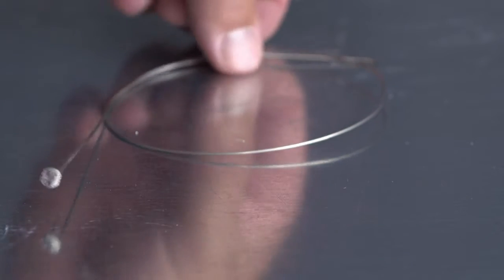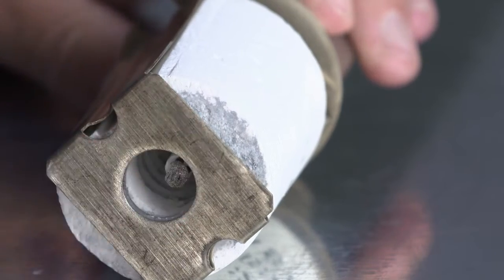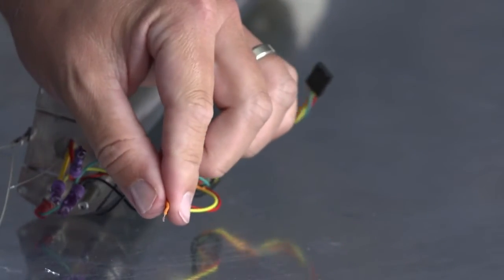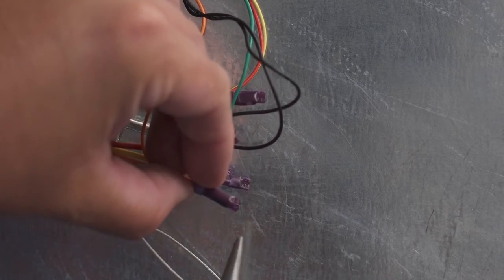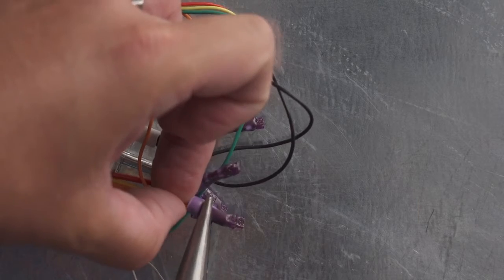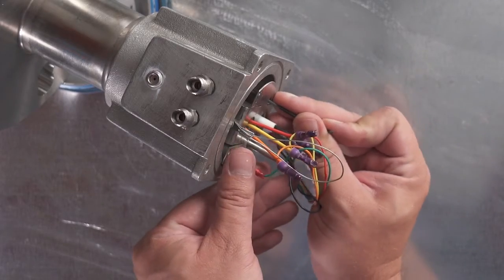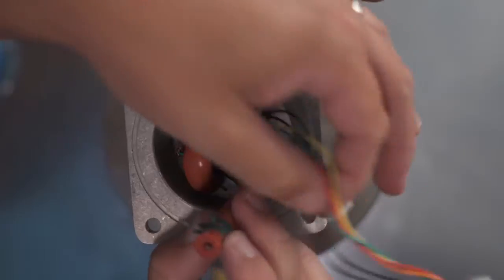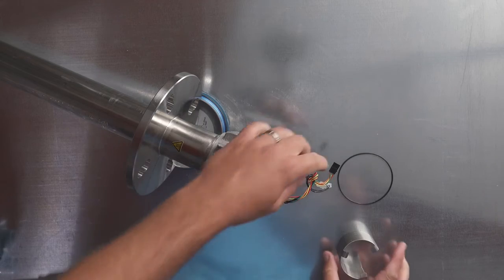Next, feed your new cell pad and wire back through the channel. Reattach the thicker orange insulator. Strip the jumper wire and connect the insulator so that a half inch of pad wire is exposed for crimping the jumper wire. Crimp the orange wire back together using the provided purple crimp. Make sure the pad wire is insulated so it doesn't ground out. Insert the heater strut back into the probe body, aligning it so the flat part aligns with the calibration and reference gas fittings. Once the heater strut is close to being fully inserted, use a small Allen wrench to guide the calibration tube through the opening in the heater strut. Reattach the red or black flexible tubes — they should not cross each other; they run left to left and right to right. Reinsert the metal retaining collar.